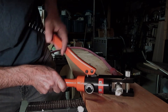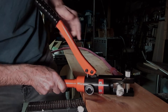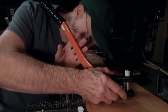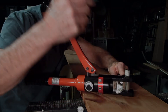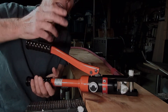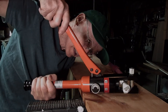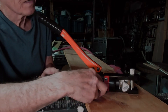I've got the lug slid onto the cable. It looks like the cable is completely inserted into the lug — I'll position it right there. Now you just squeeze the handle until the dies come together in the jaw. There — they come together. That was pretty easy.